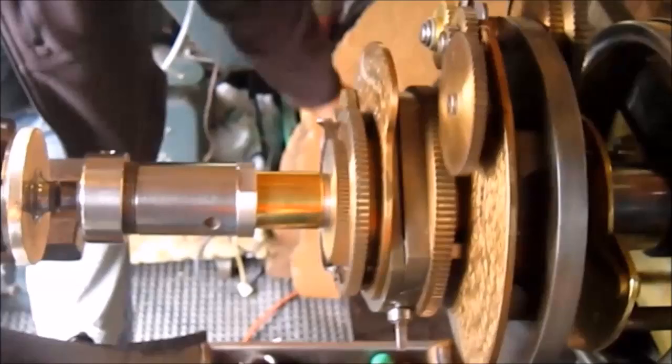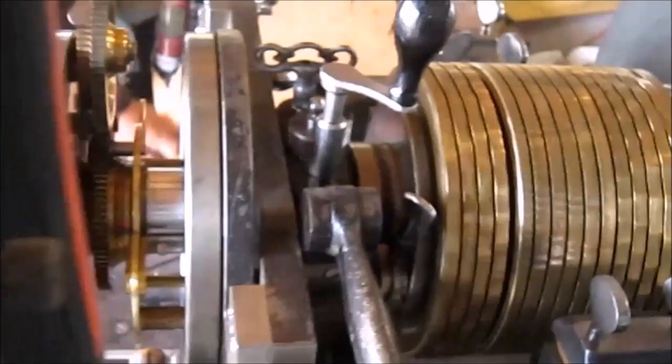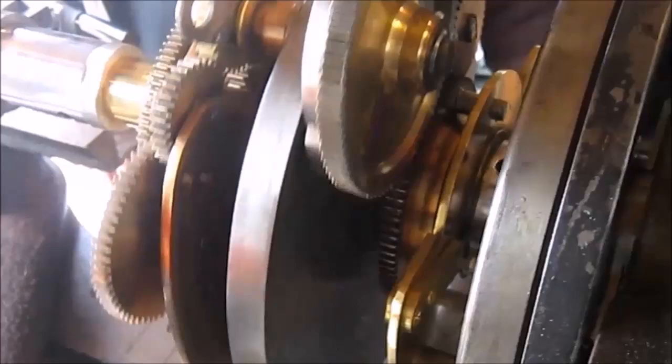Now, are the rosettes working right now, too? No, they're not. They're not engaged at all? No, they're not engaged at all. So it's all the geometric chuck. To make the rosettes work, you have to put a rubber or a cam follower against them. Right. Yeah.